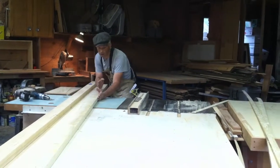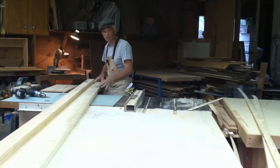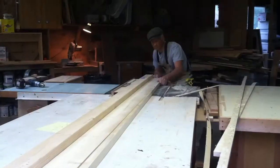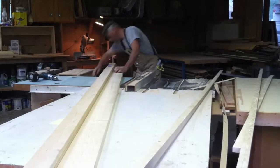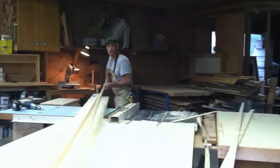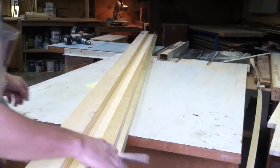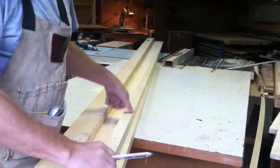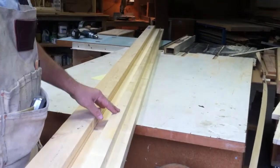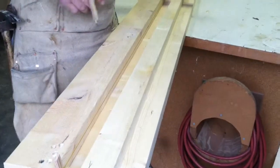With a straight edge cut here, we know that our wedge is going to work out. So after I rip it and the piece warps and bends, that's okay, because we started with a static piece. So here we go. And now, as you can see, there's our wedge right there. From 0 to that end, both sides are straight, both sides are static, 1.5 inches to 0 down there. And of course this may not look like 1.5 inches here, because actually I wanted 1.5 inches at this length. This is the last rip that I did.